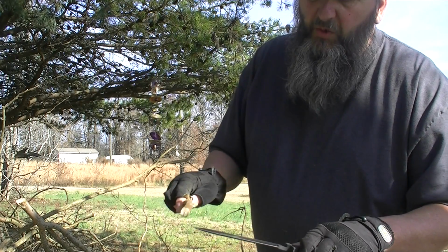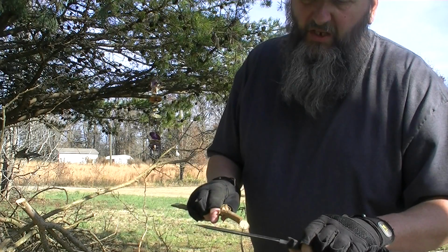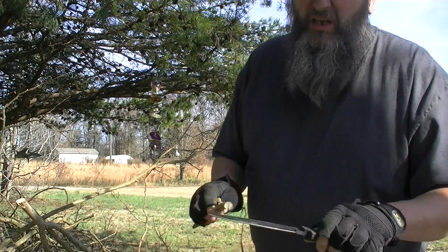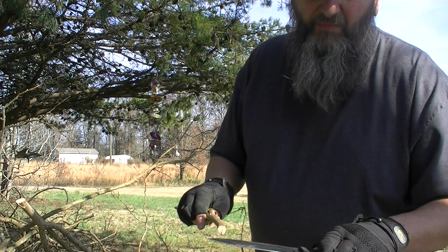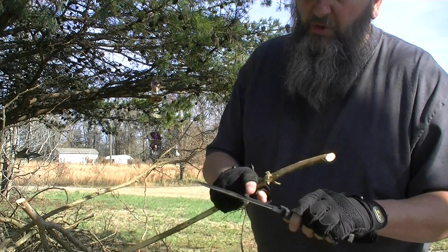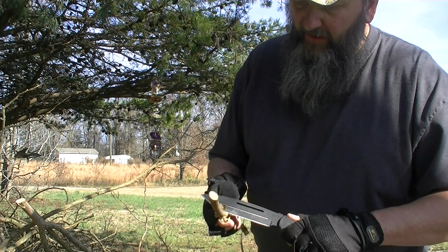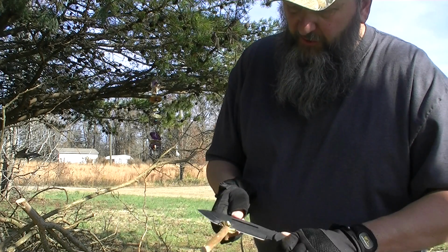So when you routinely sharpen your knife on an aggregate, or sandpaper, stone, whatever, you tend to remove steel from your blade. Most of the time, in general use, if it does not have a chip, if it does not have a nick in it, then you can simply strop it or use a ceramic rod or something like that to realign that edge without removing steel. Why do you want to take away the steel when you paid for the blade? There's just no need for it.